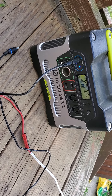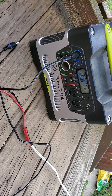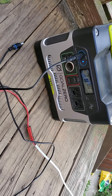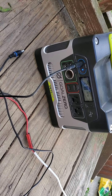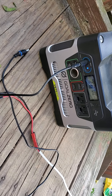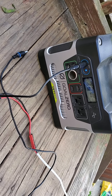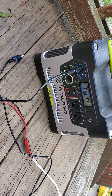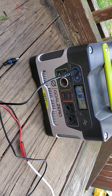For a regular lead acid battery that regulation is probably close enough to full. I know that when Hobo Tech did a review on a similar 100-watt panel, his seemed to have no regulation — it would charge up to 15 or 16 volts under load, which is overcharging your battery. Left unattended, that will ruin your battery, though if you're watching it, probably not.